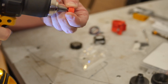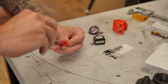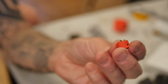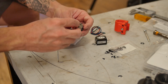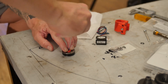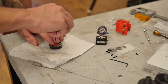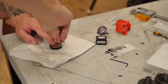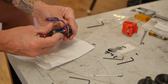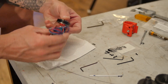I start by assembling the shaft coupler. One of the problems with this little mini harmonic reducer is that both the input and output shafts are threaded, which makes it really difficult to attach to a shaft, and I'm not really sure how these things are meant to be used. My solution was a 3D printed plastic part, but this did not work really well. I realized this right away but continued with the assembly anyway just to see how all the other parts would fit together and planned to fix it later.